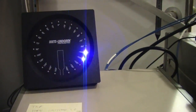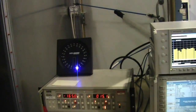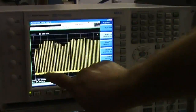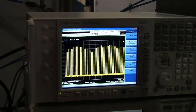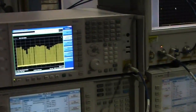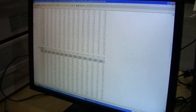What you're seeing is each one of the sensors in the system as we take a full cut around the device. This display represents the active position of each antenna, and if you watch on the spectrum analyzer you can see what's happening as a function of time — as it sweeps around the circle you can see the pattern information being recorded. We transfer that all back to the PC, process it, and convert it into position information. What we're really going to care about are the numbers at the end.